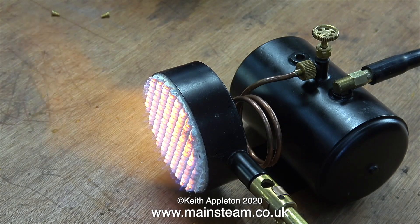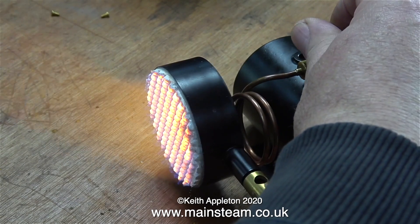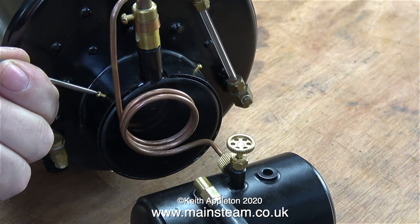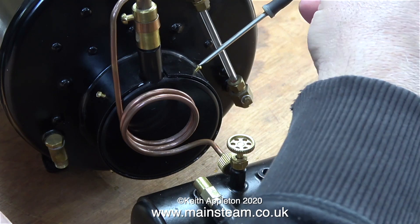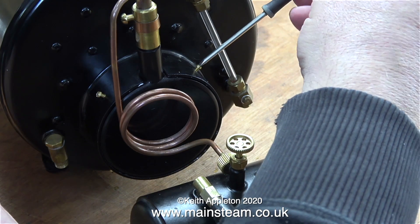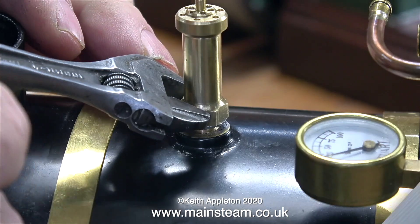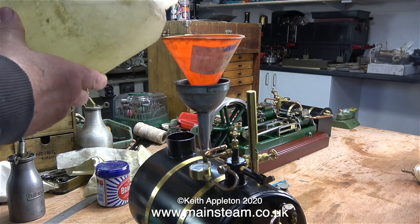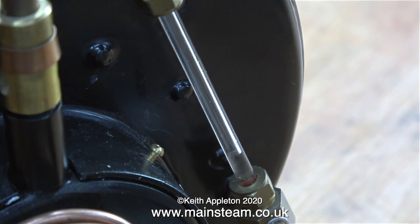On the subject of heat, this is the heater that fits into the end of the boiler - a large ceramic type burner. The good thing about this ceramic burner is the correct type of ceramic, because some ceramic burners use a different kind that tends to overheat. I had many discussions with Mike Abbott from Mac Steam about this, and we both concluded this type of ceramic is the best to use if you can get it. A quick tip when using gas-fired boilers: don't fill the boiler right to the top - aim for approximately half a gauge glass full of water. That way you'll raise steam quickly and may have enough gas left to run your engine.